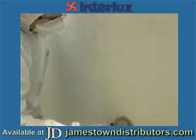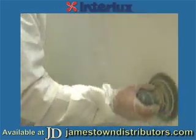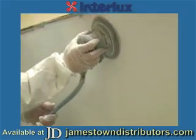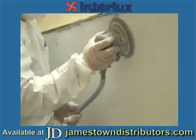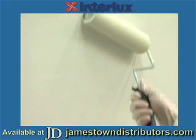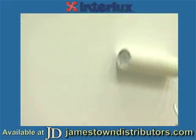Before you apply the second coat, give it a sanding with 220 grit sandpaper with a dual action or random orbital sander. This will create a better finish. You will also want to wipe off the sanding residue with Interlux brushing thinner 2333N. Apply the second coat in the same way as the first, rolling and tipping off with a brush. Make sure you recoat the entire area.